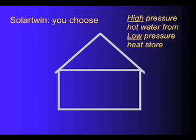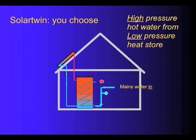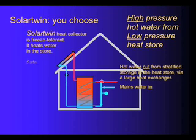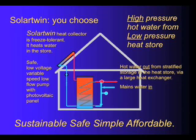There are several ways you can plumb Solar Twin if you want high pressure water. You put a water store in and run small pipes from that to the panel via the pump, which puts hot water at the top of the store. You take the heat out of the store using a large heat exchanger which takes cold mains water, adds that to the bottom, flows the water through, and then takes the water out from the top via a thermostatic blender valve. It's a low pressure, low voltage, simple system.